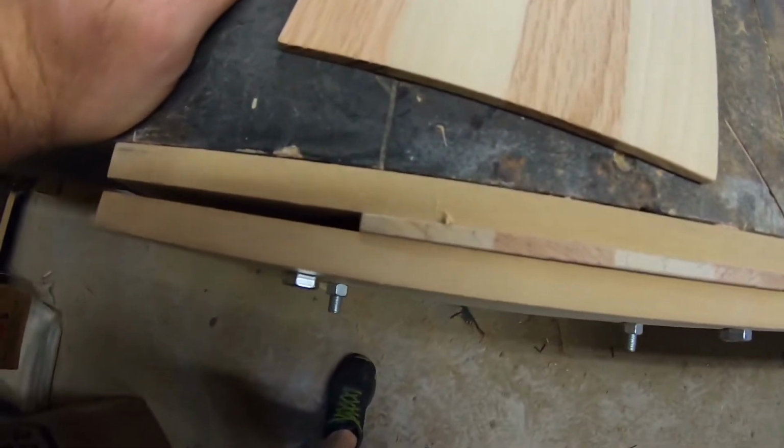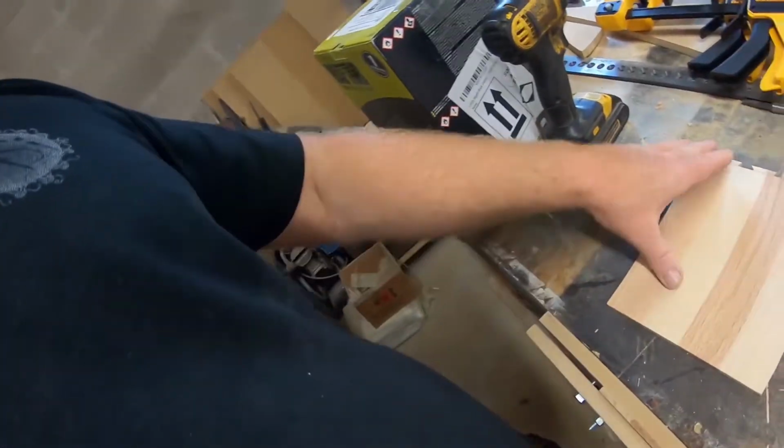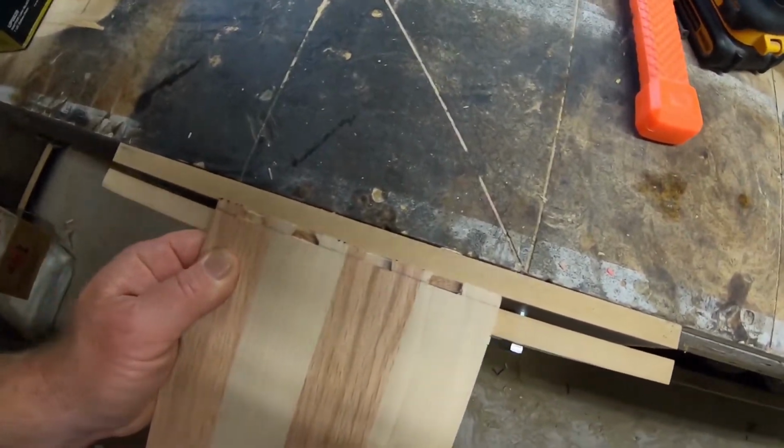Those are the tails. So now, in my makeshift vise, I put the other side piece in, and now I'll draw what is the pins on it, like that. And then I'll cut that out with the chisels. And these are harder because you're just drawing an angle on the side, so you got to cut the angle and you got to chip that way. You got to chip out the fat side. So I'm gonna draw these on here, chip it out.